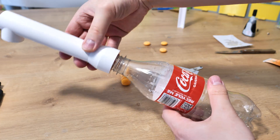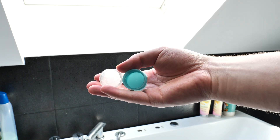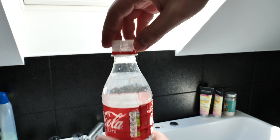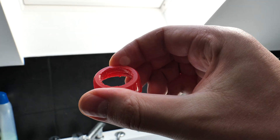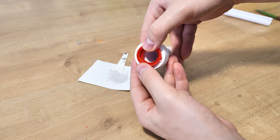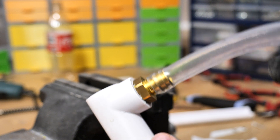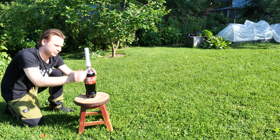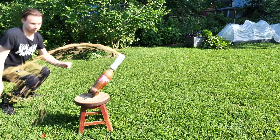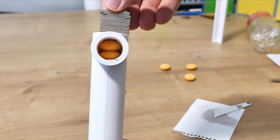Now when we have the parts, there is a little assembly required. This will screw onto the bottle like a cap. I tried to design threads and did some test prints with FDM and resin printers, but I just didn't succeed — they were leaking badly. So I came up with an easier solution: I just cut a hole in an already existing bottle cap, glued it to my Mentos feeder device, and now I have my threads. It fits on the bottle perfectly and also seals it. We also have to attach the tube, but first I just had to see if it would even work. Here is my first Coca-Cola and Mentos run ever. It didn't go exactly as planned — the Mentos didn't want to fall into the bottle. It came loose but didn't pass through the cap. After a bit of shaking it did pass, but then I wasn't ready and it fell over. So I fixed the problem with the cap by cutting the opening a little bit bigger, and now it works.